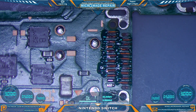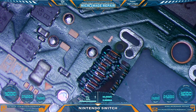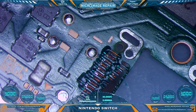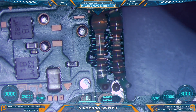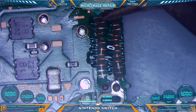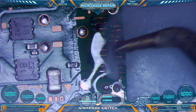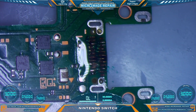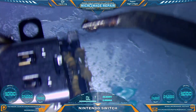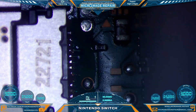Next step is to grab the UV lamp - I'm just going to set it on here, step away, take a break and let it get a really thorough cure. Lamp is placed, looks like we got a nice solid cure, no movement - very good. I don't want it to burn off the enamel. Using our normal method of putting a ball of solder on our tip, we just want to run the ball over the wires - not really trying to make contact with the tip itself - and tin up these wires real nice. If it sucks up into the iron we'll know it would not have survived the reflow. It appears every wire has survived and we are prepped for port placement.